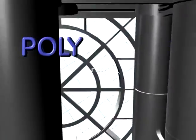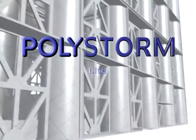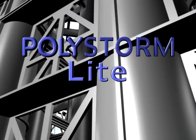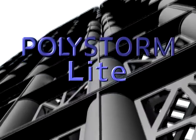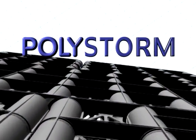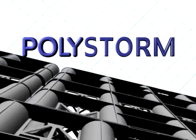There are two types of cell to choose from. Polystorm for trafficked areas has a load-bearing capacity of 44 tons, and Polystorm Lite for non-trafficked areas has a capacity of 20 tons. Both take only 10 easy steps to create the ideal soak-away solution.